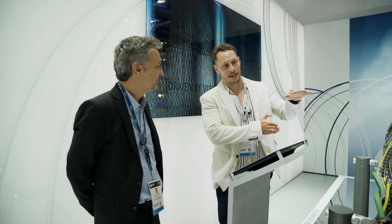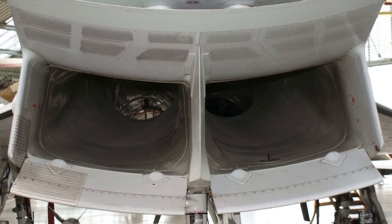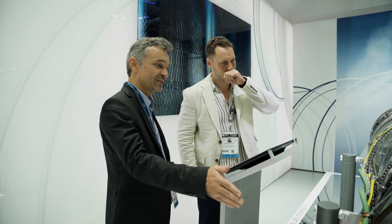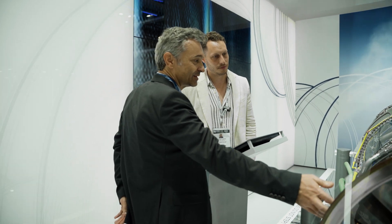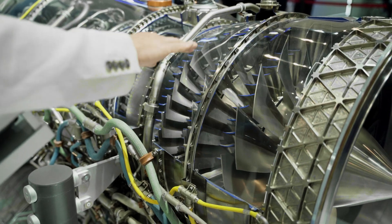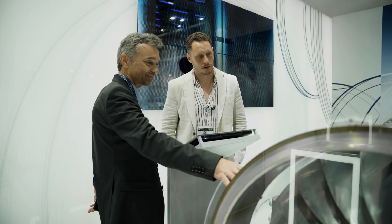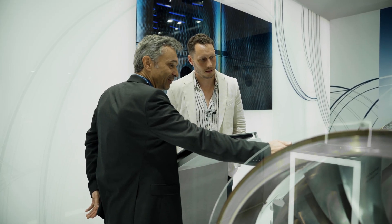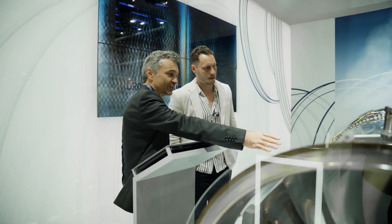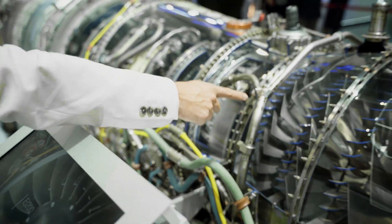From the front there is a long air intake, and then basically when the aircraft-to-engine interface comes, that's where we start here — that's the inlet of the engine. It's a two-spool turbofan design, so you have three low pressure compressor stages that compress the air to a certain level. After the low pressure compressor, the air stream divides into the bypass section, with a small percentage going through the bypass.